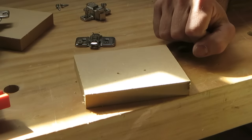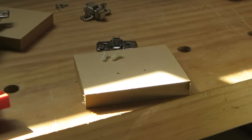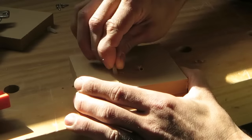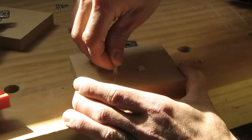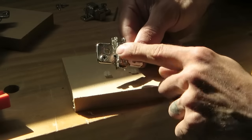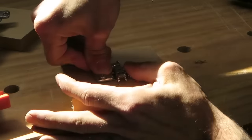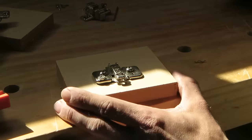These kinds of mounts take a 5mm hole because they have little plastic grommets — I'll put them in. Usually these plastic things are attached to the hinge; it's just when you take them out they have to come apart. The actual steel base plate will go one way — this one has an arrow pointing to the front of the carcass, so I know easily what way it goes. Then screw that in, and that is that part.